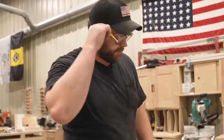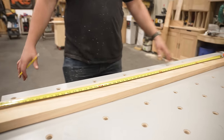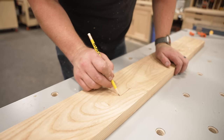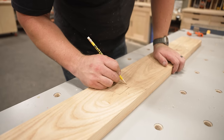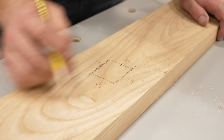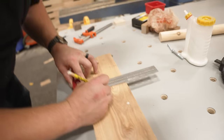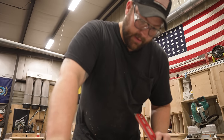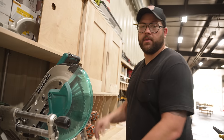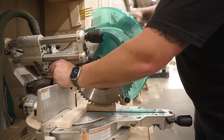I have absolutely no clue what I'm doing here, but I've got about 60 good inches of what I think is elm. I'm wondering if I can curve it into a box, which means I need four curves. In a perfect world with 60 inches I'd go 15, 15, 15, 15 — but I want to meet at a square spot, so I'll go seven and a half. Our boy probably has about a cut every quarter inch, so that'd be nine cuts. What I'm going to do is use a miter saw with a stop block.